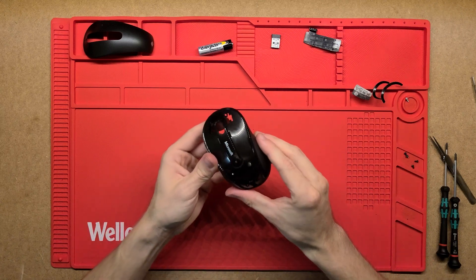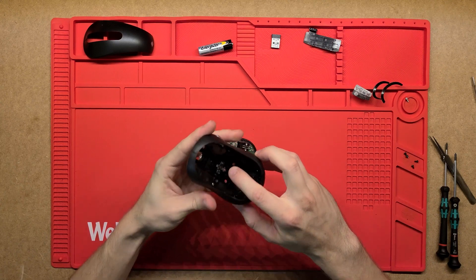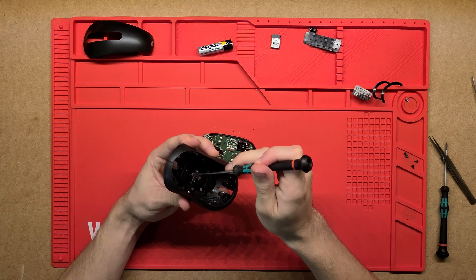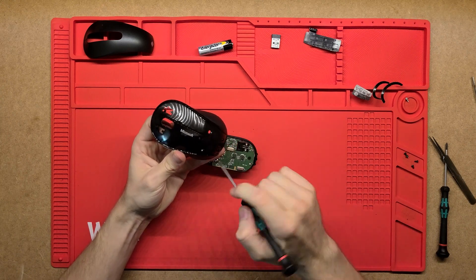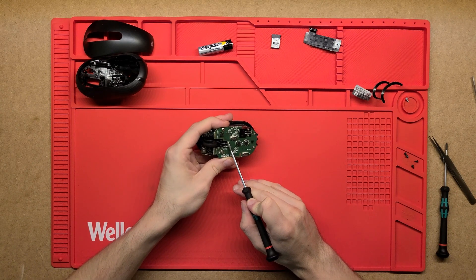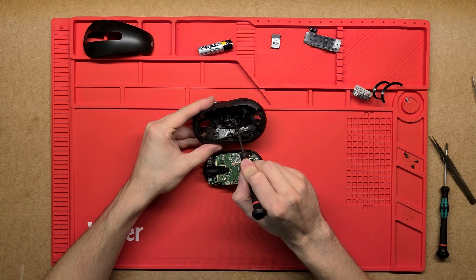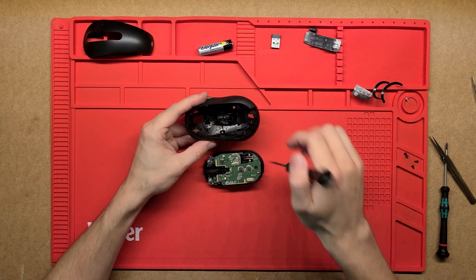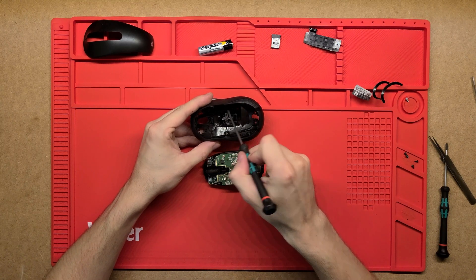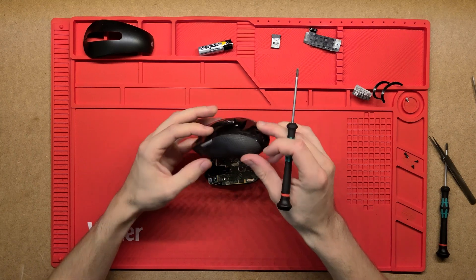The shell is made up of three different parts. The right side and the left side have a rubber grippy coating just to grip it better, and then this is a standard plastic cover. There's a little channel of translucent plastic that the LED would shine into and guide through to come out on the other side of the top. So there's an LED just there — it shines down, travels about 10–15mm, and then gets shot up. There must be a reason for routing it that way, maybe to do with how it's held in place.